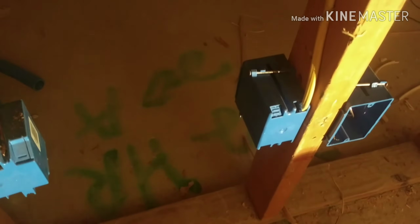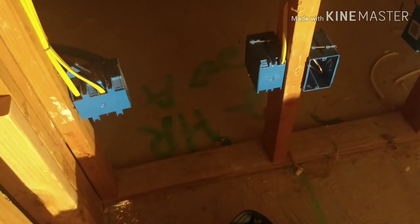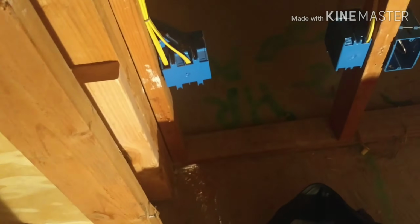Basically what you're going to do here is creating an in-wall extension. So there's a product on Amazon which is called a power inlet, not an outlet. An inlet is something which has a male plug. So that will plug into the UPS and the UPS will plug into the 20 amp, right? So that way what I'm doing is I'm using one dedicated 20 amp to run the power to the projector through using a UPS. And the other devices will plug into the same 20 amp.